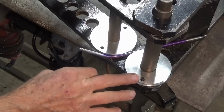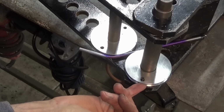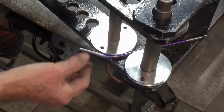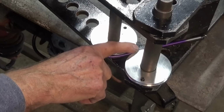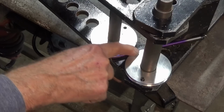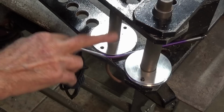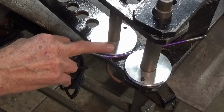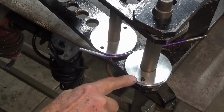Okay, this is the rig that I got set up in the Hossfeld bender. So these two aluminium dies here have got a half round profile machined in the outer edge. And that's the same diameter as the outside diameter of our stainless steel tube. I've got the tangent point sitting here, and it's against a mark that I've clocked on the edge of the fixed die. So this die doesn't move. This is the moving die, and it's attached to the moving arm of the Hossfeld bender.